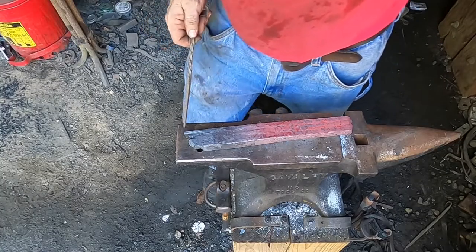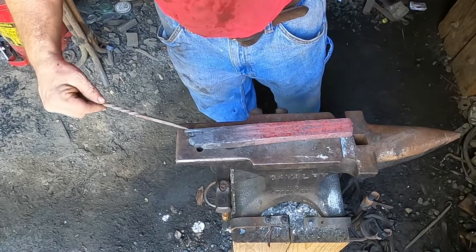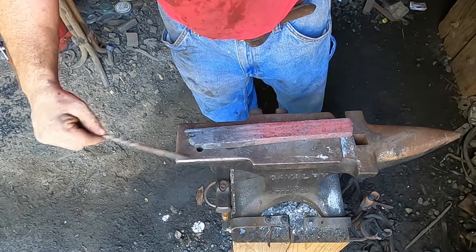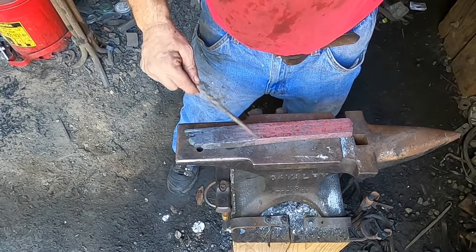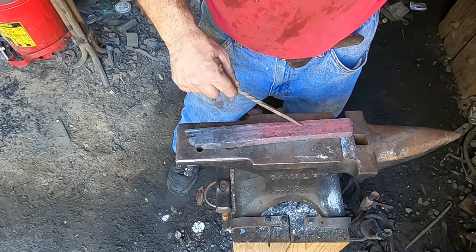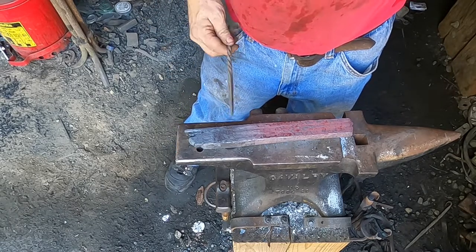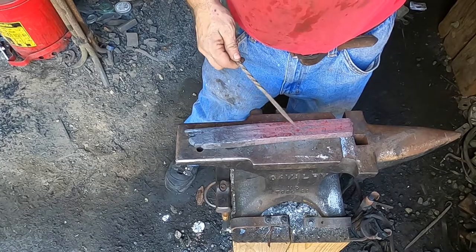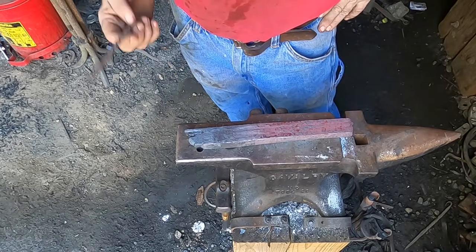Okay, first thing that'll strike you is that these ends are in terrible shape, and they are. But you'll see thinner pieces here and maybe here. Those are two, one on each outside, and then two in the center also. Three billets, or three pieces of wrought, if you will remember. And then I put in four pieces of three layers of saw steel.